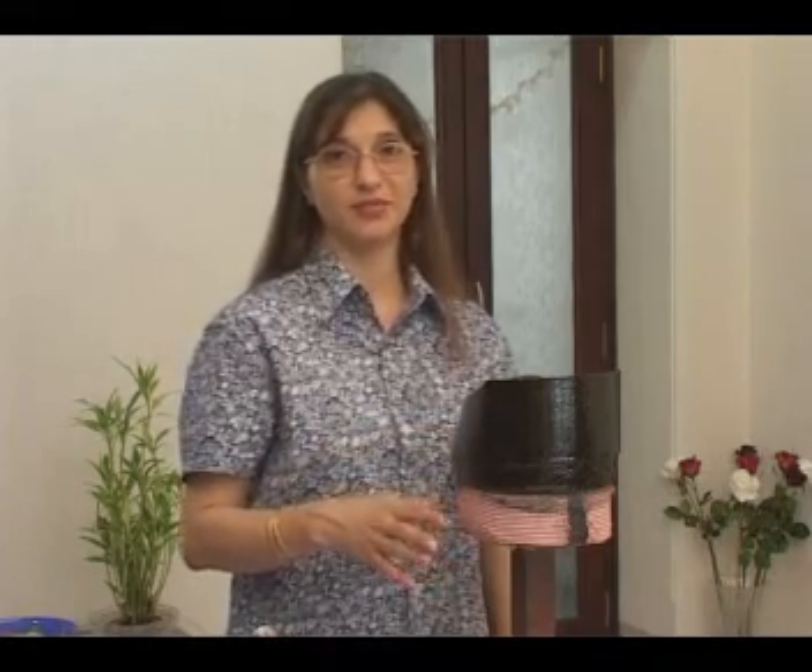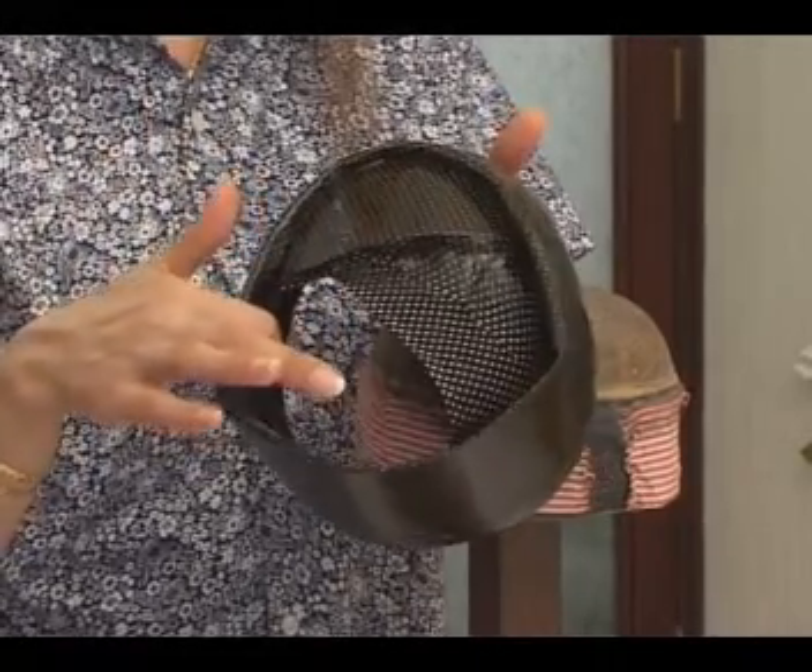You need to put five to six coats of polish, and in between each coat there has to be a drying period of at least seven to eight hours. It has to be dried naturally — you cannot hurry up the drying process.